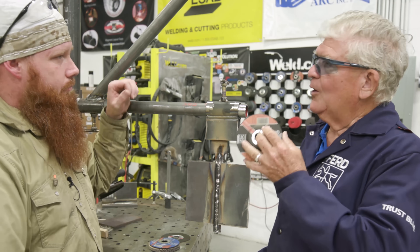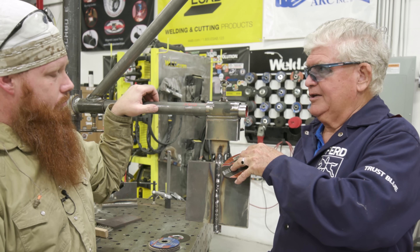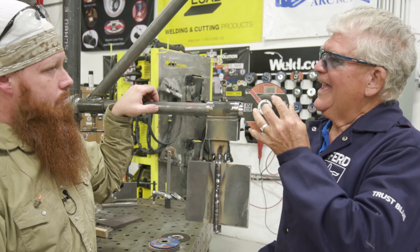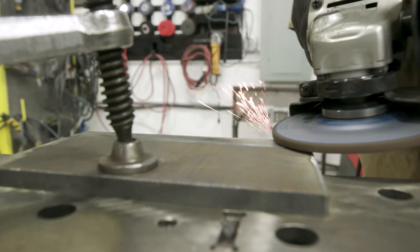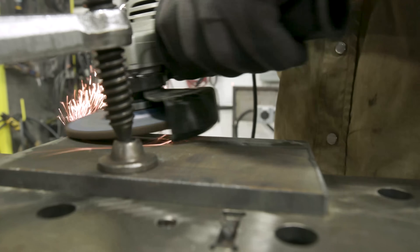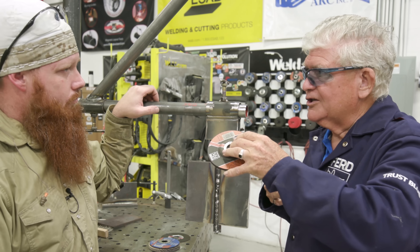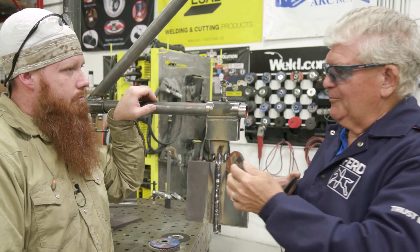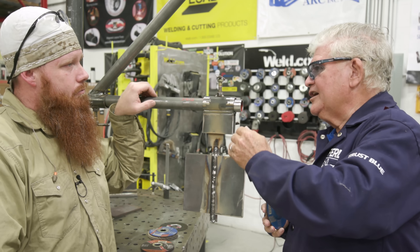This quarter inch is a grinding wheel, but most of the time people use it to take off scale and prep plates — putting a bevel on them — and that's what it's designed to do. This wheel is designed to work between 15 and 30 degrees, so when you're pushing it into place your body naturally holds it at that angle. It's reinforced at the top, middle, and bottom for excellent wear life, giving you an aggressive and safe wheel. But when you try to go on edge with it, you start to fight it and the wheel can break down.